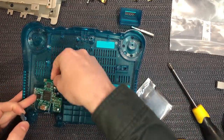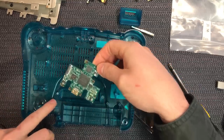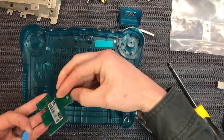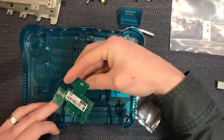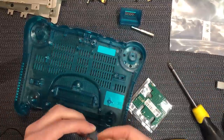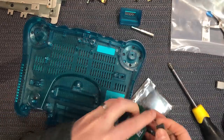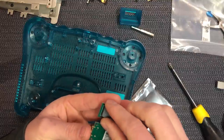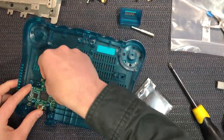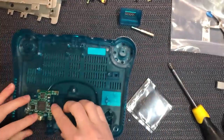Just take your time with a normal small file, and just cut it really slowly and carefully because you'll be surprised how quick it actually does cut. As the board sits in place, it's going to rock across this bit of uneven plastic. So what we do is put a bit of foam down to this corner, which actually sticks to the underside of the board inside that rectangle, and that way we get a bit more support out of the board when it's in place. Get the included bit of foam, peel off the backing, and put that in place. We can still access the pads if we need to, and it gets support on that edge there.